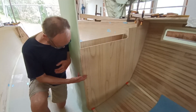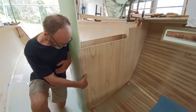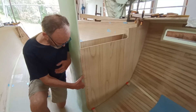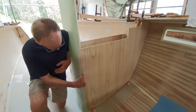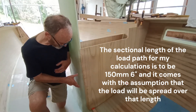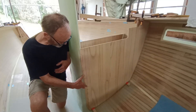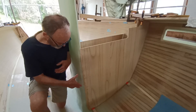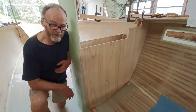The top of the dagger board lies about here, so there will be a lot of loading in this area. I'm not worried about the compression, but I'm a bit concerned about the tension. The initial area of tension will be at least 100 to 150mm long, and I'm wondering how many layers of BIAX to put around this corner on the trailing edge and the leading edge of the dagger board case, to give it a good safety margin and account for any shock loading.